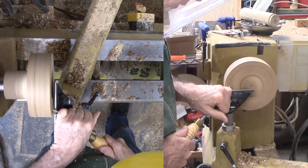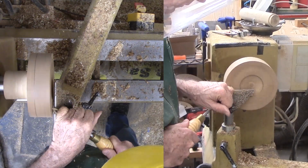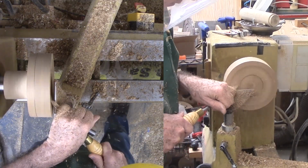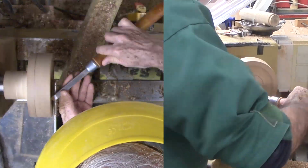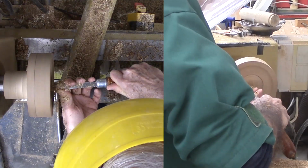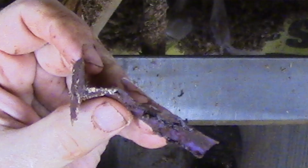I plan to cut more wood from around the mortise, but inside the perimeter. A gradual shallow curve. I decide to sand as I go, and this time to wet sand the mortise and the box bottom. This sanding is with walnut oil. Since the oil is food safe, I do not have to wear gloves. More significantly, the oil traps the sanding dust in ugly globs. But at least the sanding dust has never been suspended in the air, and my hands are nice and soft.